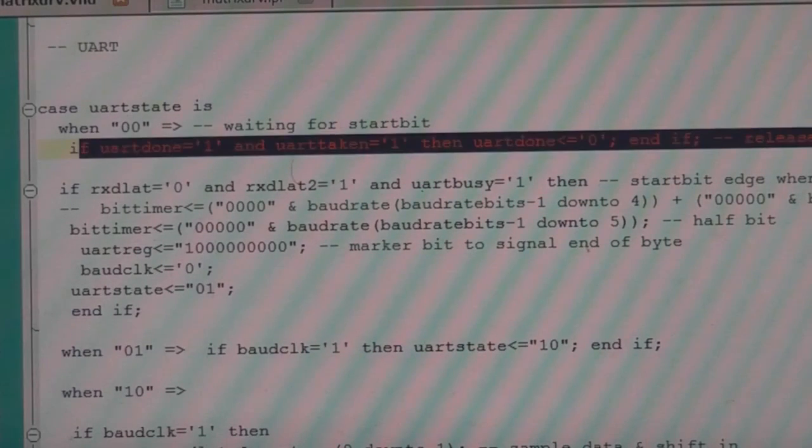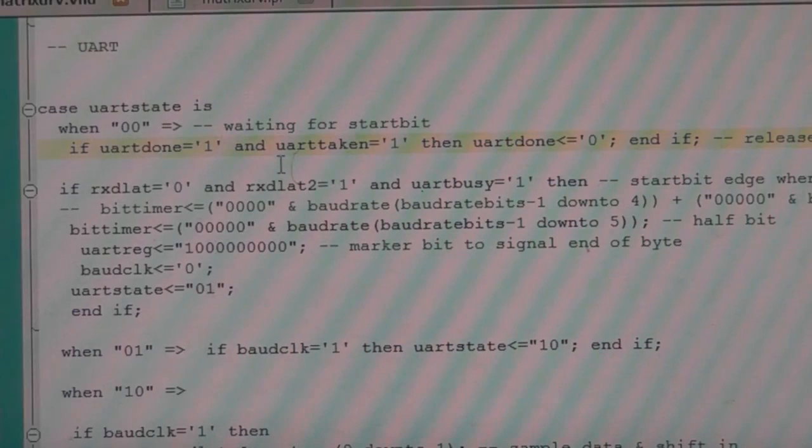This is actually a flag. Basically, when it's received something, it sets a flag, and then whoever's receiving it has to acknowledge that, just to make sure that every byte only gets recognised once. So if we see the negative edge of our start bit, and we've done our auto baud, then it generates a half bit time to get us our halfway sample point,